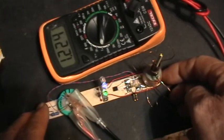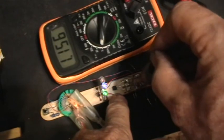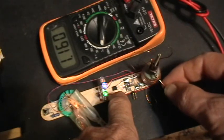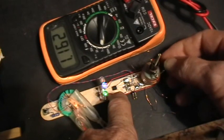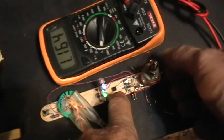Discharge some more of the voltage here. Get down to about 1 volt or so, just over 1 volt. Now by varying the position of the inductor core, you can see that we go through some cycles of dimmer and brighter, dimmer and brighter. That's just with one of those 20-turn wires hooked up. If I hook up the other one, while moving the position of the inductor, I can find little resonant peaks where the LEDs get really very bright.